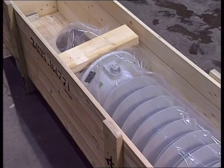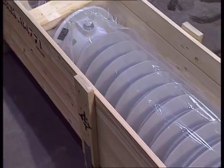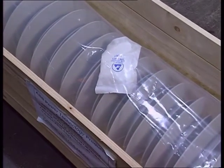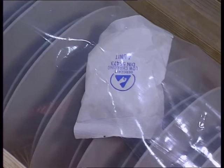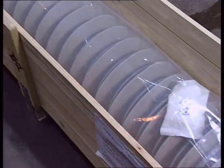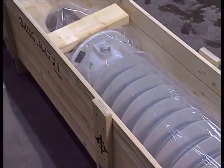This does not apply to dry insulated bushings, which can be stored horizontally. These bushings should be surrounded by a sealed, moisture-proof wrapping in their original case. Keep the bushings dry and clean, and protected against mechanical damage.